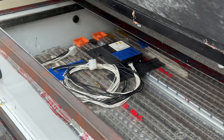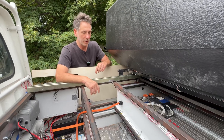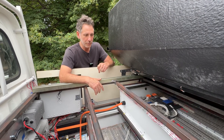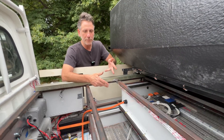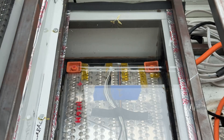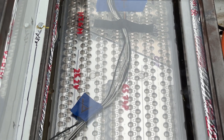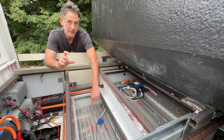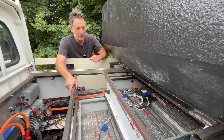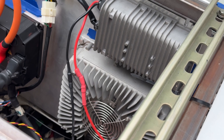Model S modules — there are five of them, so you have about 125 volts. It's a 30S, 74P pack, which is natural to the Tesla. These are basically little 18650 cells, the same you'd find in a drill battery. And that was part of my inspiration — I thought, well, we might as well make it look like where it came from.